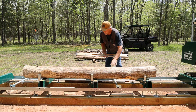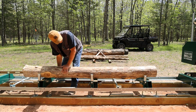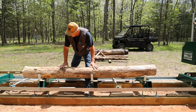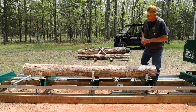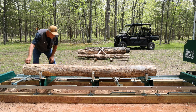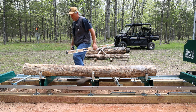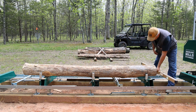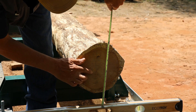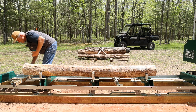I'm going to try to get as much of the crown up as I can. You can see we've got a pretty good amount of movement there, and that does make these logs difficult to actually get clamped as well. Bringing our chalk line back across here one more time — there's at least an inch and maybe even an inch and a quarter of sag in the middle. Now that we've got it pretty much level, checking it the way I've been doing: six and five-eighths here and six and nine-sixteenths here, so we're within a sixteenth of an inch.